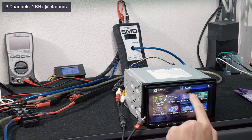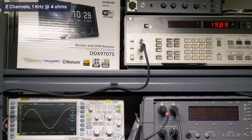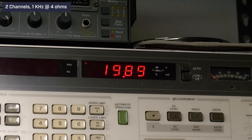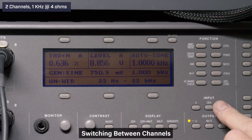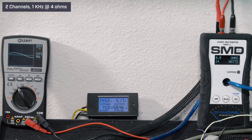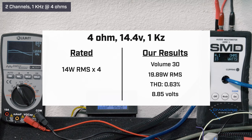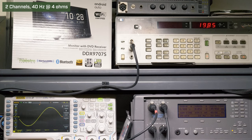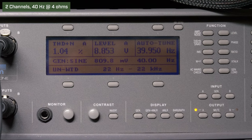Let's test this out for ourselves and see what it can do. The first test we ran was two channels driven at 4 ohms, 14.4 volts, 1 kHz, EQ flat. Our audio precision will generate our signal and measure distortion. At volume 30, our HP8903B audio analyzer picked up 19.89 watts RMS, 0.63% distortion, and 8.85 volts of output. Down to 40 Hz at volume 30, our HP picked up 19.8 watts RMS, 1.03% distortion, and 8.85 volts of output.